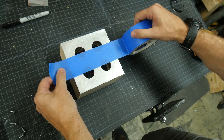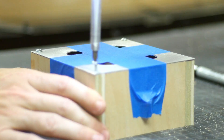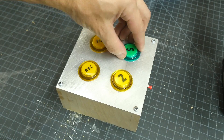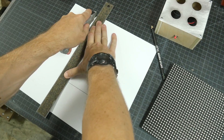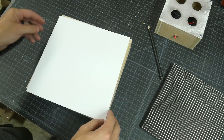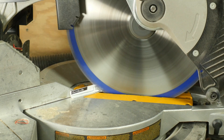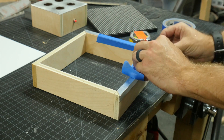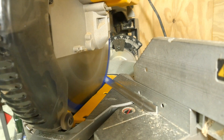When the glue was dry on the control box, I just used some blue tape to hold the cover in place while I drilled holes in all the corners and drove in screws. When the sign box was dry, I traced it out on a piece of white styrene and cut it with an exacto knife. This is just thin white plastic that's often used for vacuum forming. To frame this box, I cut down pieces of aluminum angle on the miter saw. I taped each one in place and then measured the next piece to make sure that each one was perfectly fit.